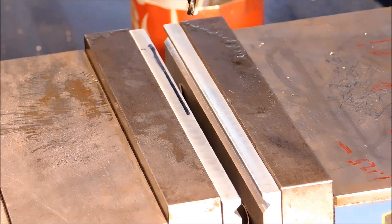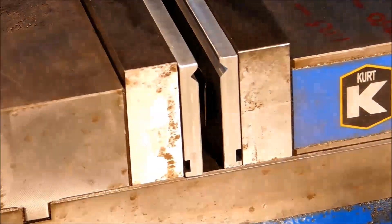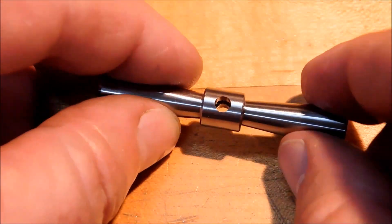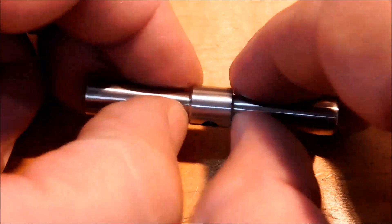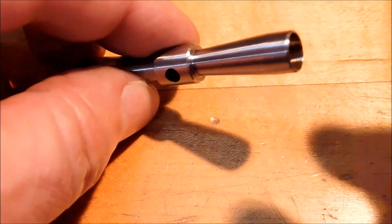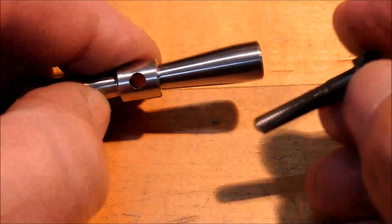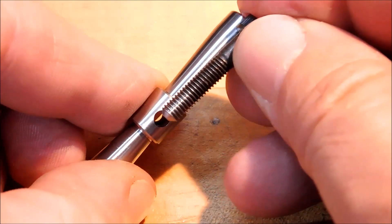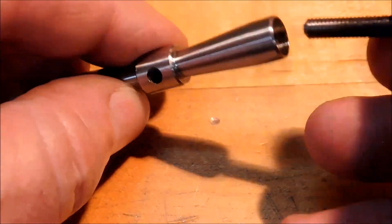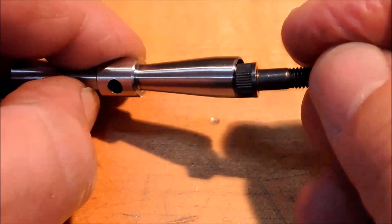Let's pop it on the bench, clean it up, and take a look. I love that thing — it works like a charm. This is the final product. It is a 150 through hole to accommodate up to a number five tap. Make sure when you do this it is completely by eye — it's very symmetrical but completely by eye for me. This one takes a number 10 screw, and the screw is just about long enough to reach halfway through the hole, because chances are you're never going to use a tap smaller than half that hole. Counterbore on the end to accept the head of the screw.